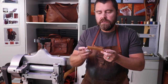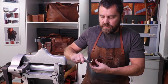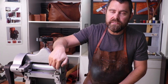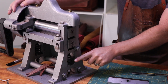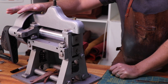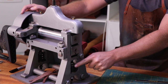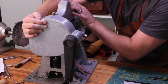Another thing people have often asked me is how I've managed to get my splitter to split so evenly on the left and right hand sides of the leather passing through. My splitter will split to around about a 1/10th of a millimeter variance side to side. The way you do that: these rollers can be moved independently up and down, so you need to make sure that the rollers are sitting evenly. The last of the three critical things I would say to get one of these machines working nicely is adjusting your spring tensions. It has a spring on either side — on the crank side, for whatever reason, the tension needs to be a lot less, because the bottom roller is supported a lot by the extra weight of the steel and how the cranking system works. So my spring on the opposite side of the crank has a lot more tension on it than the side that has the crank.